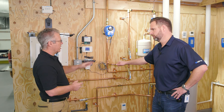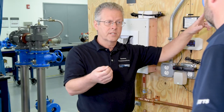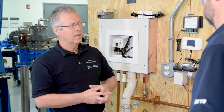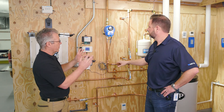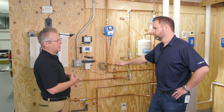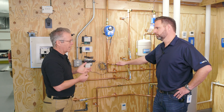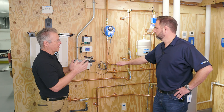This actuator has an internal non-condensing heater inside. When the temperature gets below about 60 degrees Fahrenheit, the heater activates to prevent condensation from damaging the electronics — so there's a built-in safeguard against cold. Also, it's a high-torque motor and high-torque actuator with electronic protection, so that in 15 or 17 years if you've got high calcium deposits in your water, it's got the strength to keep on going decade after decade.